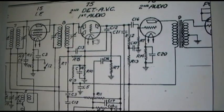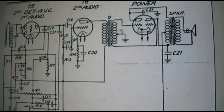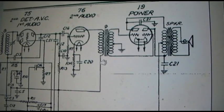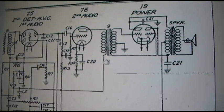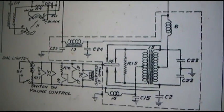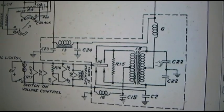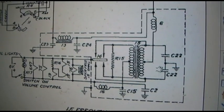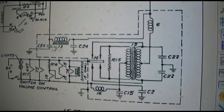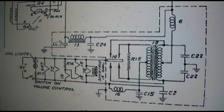Also, note that this was not a restore — I did not change one single wax paper capacitor in the radio. This was simply a 'get it working' deal, and it works very well. I ended up leaving the original vibrator transformer and basically put two diodes in parallel with these capacitors to filter the voltage. I then replaced the original filter capacitors with 10 microfarad capacitors.